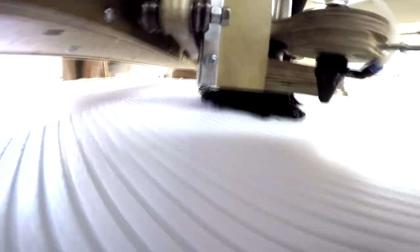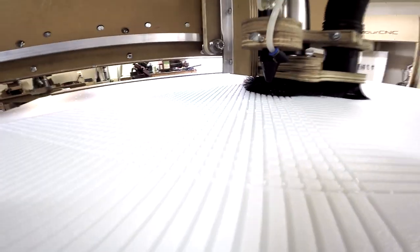Yeah, and even what I'm noticing is it's crisscrossing. It's not just one set of diagonal lines. It's two sets of diagonal lines crisscrossing. So in the machining process, it's going to be going through material, then no material, then through material. So you're putting an interesting type of stress on the machine that I don't think we've ever really experienced, because we don't do this type of machining. So it's going to be soft, hard, soft, hard, soft, hard, soft, hard as it goes through. And this is what the customer wanted, so we had to do it.